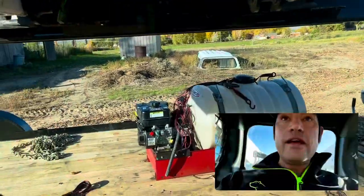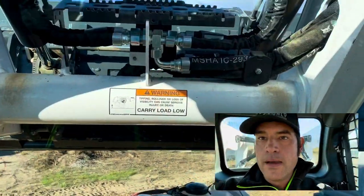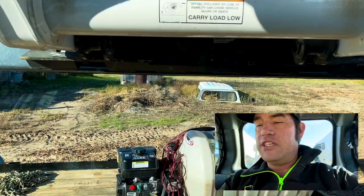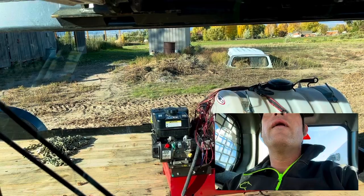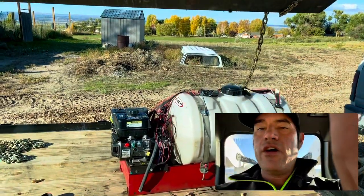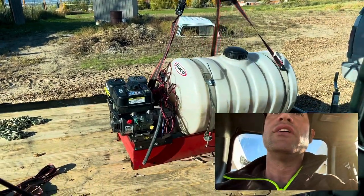Let's see what we can do here — got to get this thing up over there. Got to put the parking brake back on. I have bucket leveler so that no matter where I pull it up, the bucket stays level. It's in auto idle, so it's going to idle after about five or ten seconds — you can adjust that — and it helps efficiencies to a very large degree. But I've got a little bit of a problem: I can't get out of this thing to get that hooked up. I've got the chain set up now — that was a little sketchy. I hate having to get out of this thing with the bucket up, but sometimes you just have to. Make sure your parking brake is on when you do that. Hopefully this chain won't pop off because there's no real good area to attach these straps to.